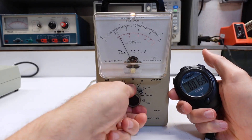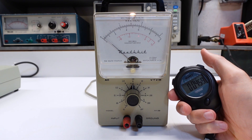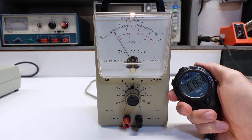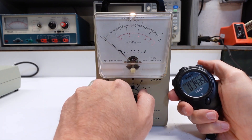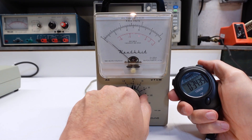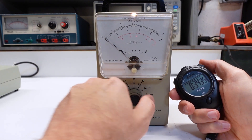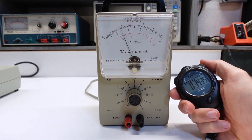However, I'm seeing some very bizarre behavior of the meter needle during power-up. It's normal for these old vacuum tube voltmeters to display some erratic needle motion while the tubes are coming to emission, but I've never seen a meter behave quite like this one. It kind of looks like there's some oscillation happening in the amplifiers, maybe as the various capacitors get charged up. After several seconds of this wild swinging, it does damp down and the needle settles to zero volts. It also does a shorter version of this dance when switching from the 3-volt to the 10-volt range. If any of you have an IM38 or its predecessor the IM21, let me know — is this behavior typical?